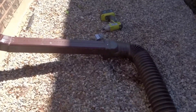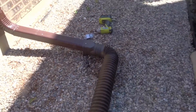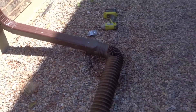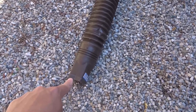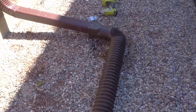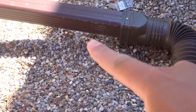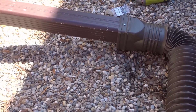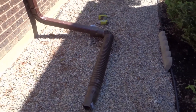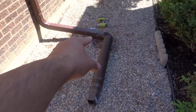Now I will show you something right here. This is an oversized downspout — we have the metal downspout and it's sort of larger than the usual ones I've dealt with. So I had to use the bigger side of this flexible downspout; there's two sides — the bigger side and then there's a smaller side over here. This is usually the one I would use, but because the downspout is a bit oversized, I had to use that bigger side. As you can see, it sort of sticks out from below — the downspout ends here but this sticks out from below, and that could cause a problem in the long run. So for a permanent solution, I'm going to take this metal downspout and add an adapter to bring it to the proper sizing.